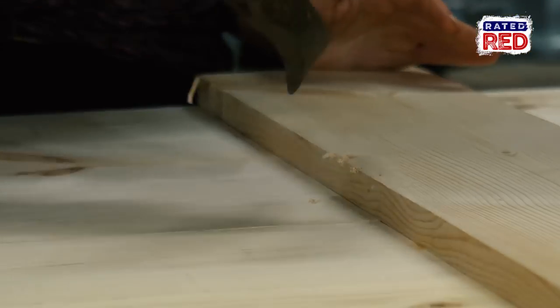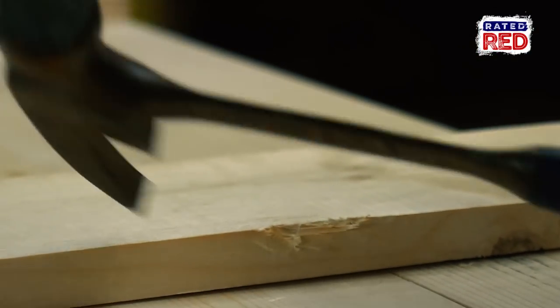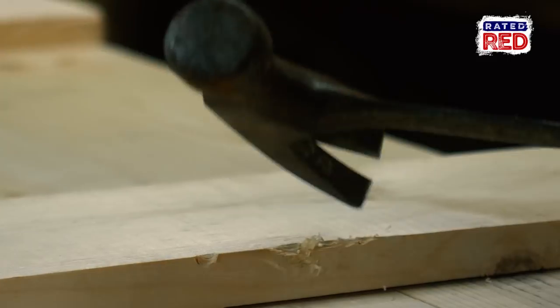There are lots of ways to do this. However, one of our favorites is to use the claw side of the hammer and go after the board edges. Make sure you hit them at an angle so it will take chunks of your edges, instead of just holes where your claws went in.